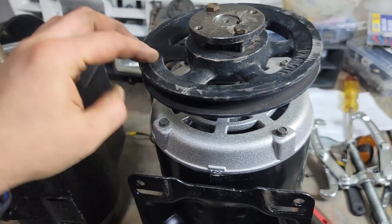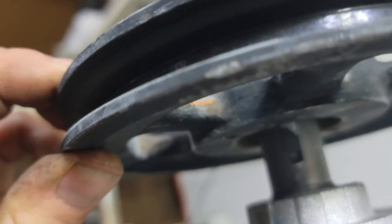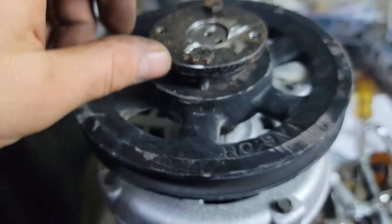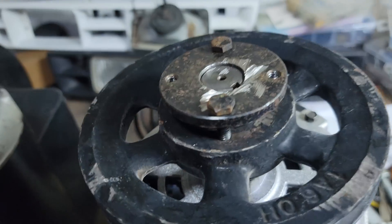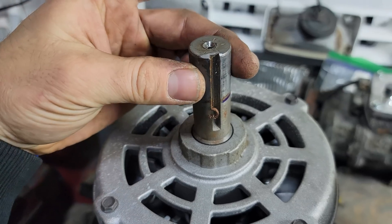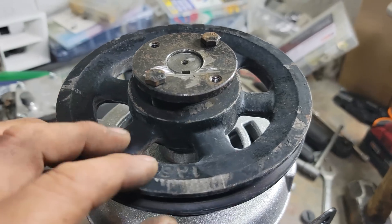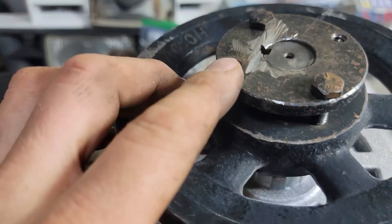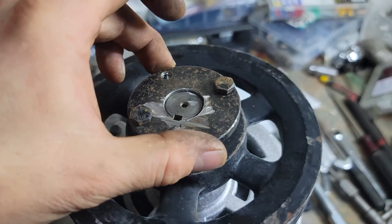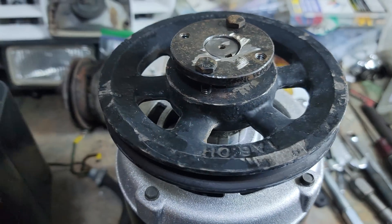The pulley is loosely positioned where it should be — I tried marking with a marker but that didn't quite work out. The plan is to move the motor back into the compressor, bolt it in, make sure the belt lines up, then do final adjustments. I did have to grind down the keyway because this shaft is slightly different from the original motor. I put the key in the freezer to help it fit, then tapped it on with a hammer. Remember to put the pulley on first, then tap it down onto the shaft.